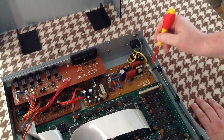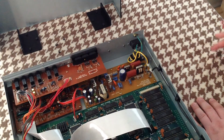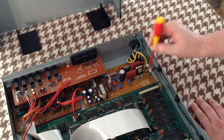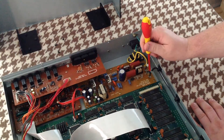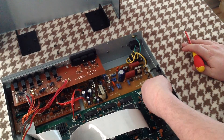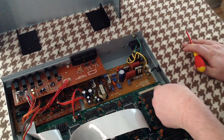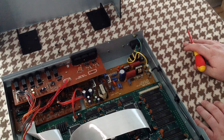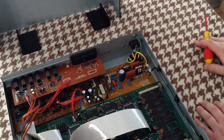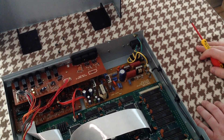In terms of what the board says, hot is live (black) and cold is neutral. The other two wires you need to solder are the SW positive and SW negative, which are these two wires here. You can tell which is which because on the SW negative there was actually writing on the cable. That just goes to the on-off switch at the front of the unit, so it doesn't really matter if you get it the wrong way around. And that is all you need to do to convert your M1 from a US spec to a UK spec.